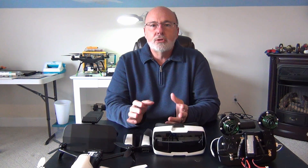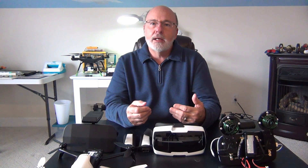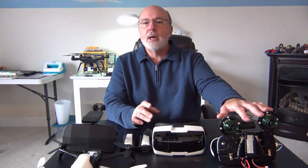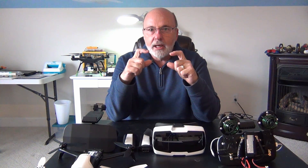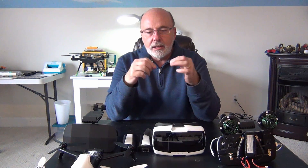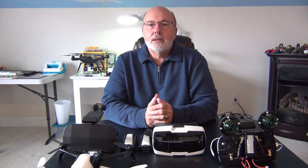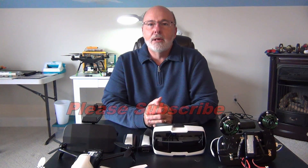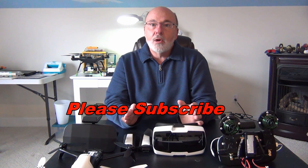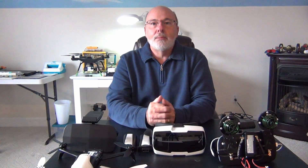I hope this helps a little bit. I'm going to try to give you some descriptions on how to do it. I didn't take too many detailed photos along the way — it's not hard. Once you pop it apart, you have two antennas at the top that you'll unsolder and pop out. Your little pigtails go in there, come out the frame, and then just follow the description I'm going to show in my photos and you should be okay. It will work for the Disco as well as the Bebop 2. Take care, bye-bye.